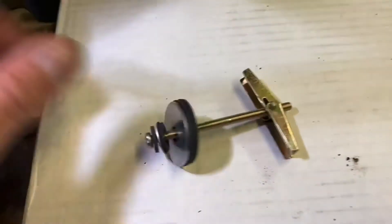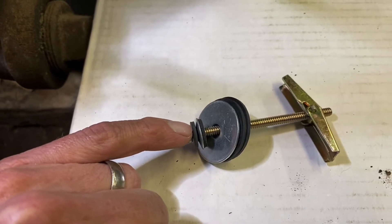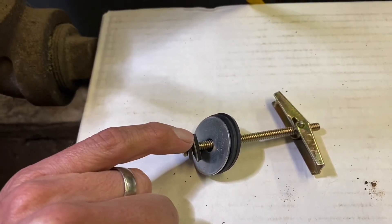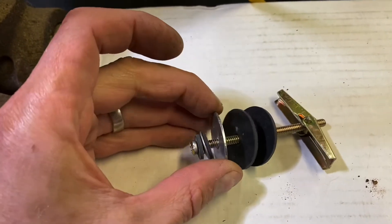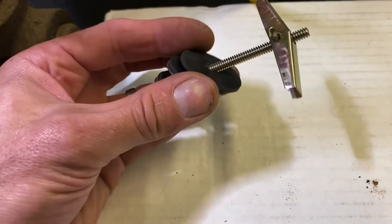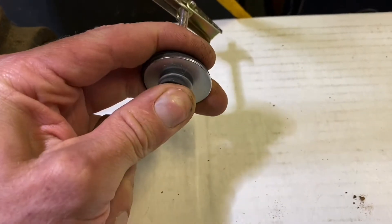What I came up with is this. It's a toggle bolt with a small neoprene washer — this is optional depending on your toggle bolt. It's basically using a toggle bolt to press a fender washer with some neoprene gasket washers to suck that in and seal the hole.